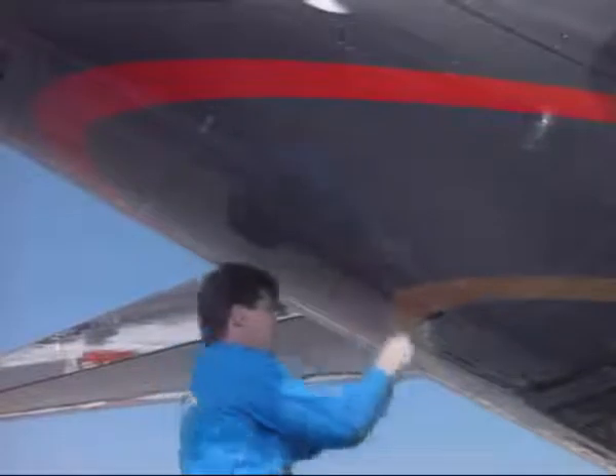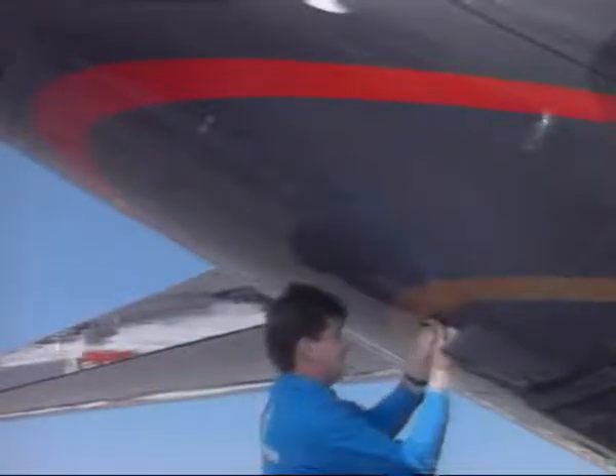To secure these latches, release the latch hook by pressing the latch release lever. Engage the latch hook in the locking bracket and close the latch lever. Ensure that the latch release lever is flush with the latch. Repeat the closing procedure for the remaining latch.